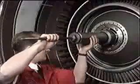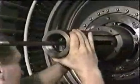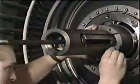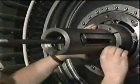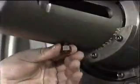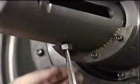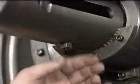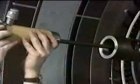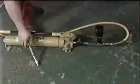Slide the plunger rearwards and screw into the thread in the LP turbine shaft. Fit the hydraulic fixture onto the guide. Secure with the 6 cap screws and fit the guide pin through the fixture into the plunger. Assemble the hydraulic actuator onto the fixture, ensuring the piston is to the rear. Connect the hand pump.